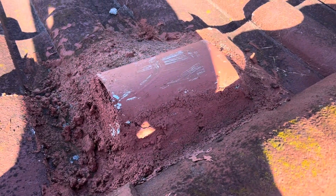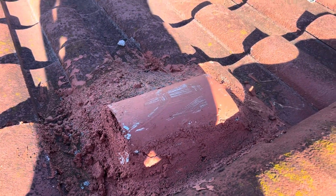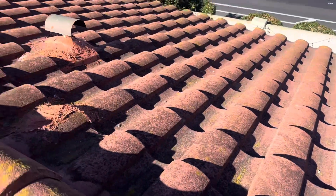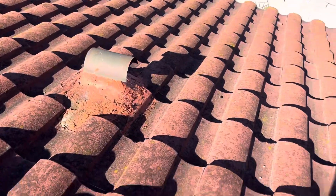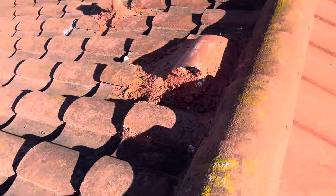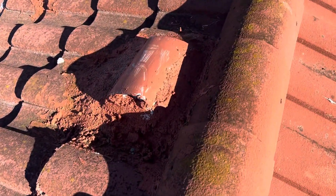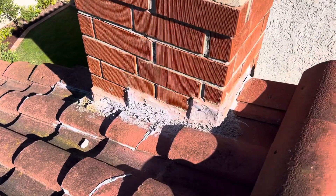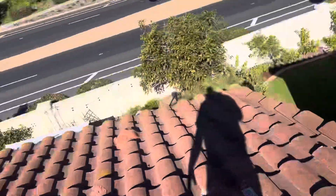Some fundamental flaws in the back of the roof: we've got a severe amount of mortar that's been used to block some of these sewer vents. We definitely need to update these with new metal flashings. This is a very old style flashing — building practices that have been updated — and you need to get this down, as it's a really good way to trap water on the roof. You can see a little bit more of this applied to the chimney area, which is also a very sensitive area.